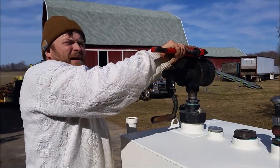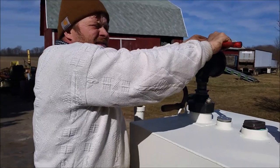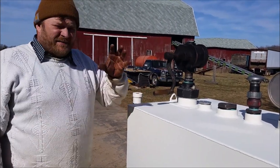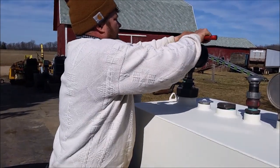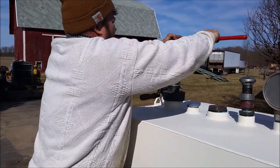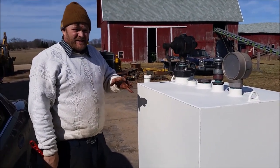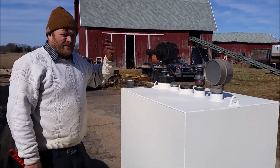This was the day tank. They probably had a big tank elsewhere — they like to have a day tank, like a generator. The day tank is inside so you can see what the fuel is doing, look at your level; it's inside where it's warm and fed by a big supply elsewhere. A lot of times the day tank is just 15 or 20 gallons, but this one was the day tank inside with the generator. It takes up so little space because it's square.